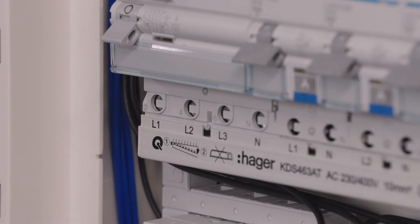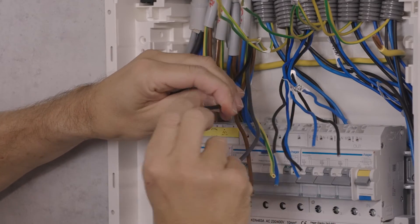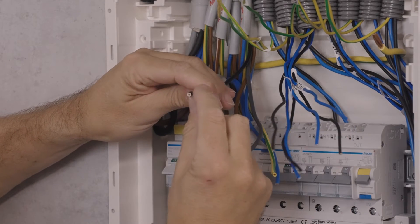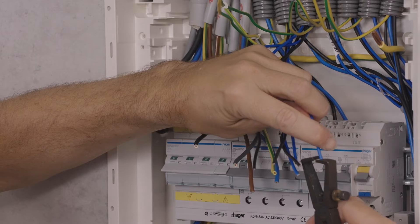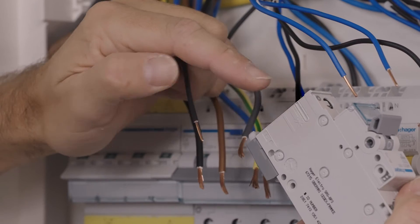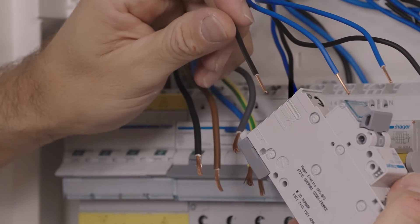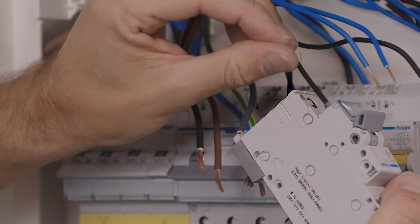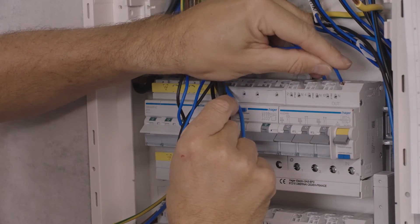For the outgoings, you can use both rigid and flexible wires with cross sections from 1.5 mm² to 4 mm². Just strip the wire correctly to a length of about 12 mm — you can find a visible pattern provided on the side of the QC devices as indicated. Note that cable ferrules for flexible wires are not allowed.